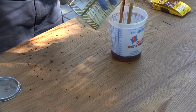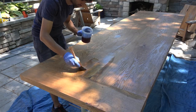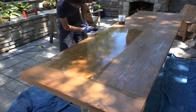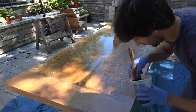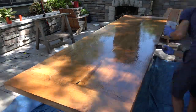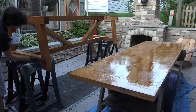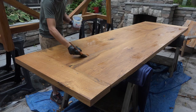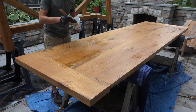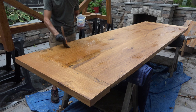The finish I used is Epiphanes — a really durable outdoor marine varnish that comes thick in the can, allowing you to thin it to whatever consistency you want. I thinned mine about 20%, which made it flow out really nicely when brushed on. I applied five coats of Epiphanes over the course of about a week, with each coat taking around 24 hours to dry, working outside and dealing with rain. The regular Epiphanes has an extremely high gloss sheen, which wasn't the look I was going for, so I applied two coats of their matte top coat, which knocked down the gloss for a really even look.